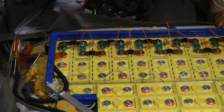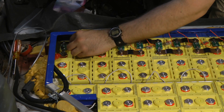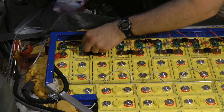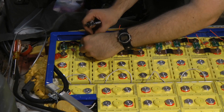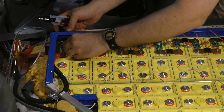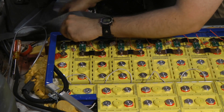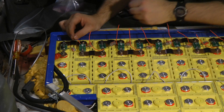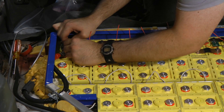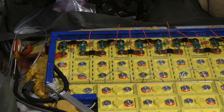Now that all the boards for this bank are installed, we just have to connect up the communications wires. We just use these little quick connect things to cut the wire to the right length, strip it and insert it in. In this case, we're going to cut off a couple of centimeters of each wire so it can be inserted. There we go. Now we just have to do that for all of them.